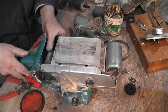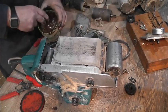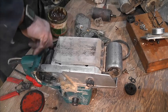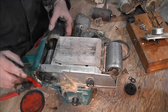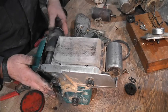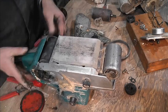We've cleaned that out a bit. If you notice, there's a long bush in there — a very long support bush with a bronze bush in it, very nice. We'll put some grease in there. We're putting this shaft into the right body — working that grease through — brilliant.